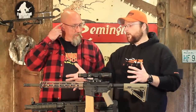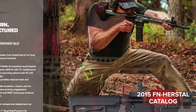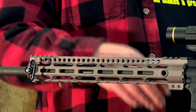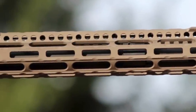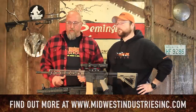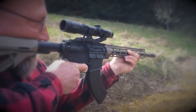At SHOT Show this year this was a very popular item, and there were even some manufacturers incorporating this handguard onto their high-end rifles. It comes complete with Loctite — you secure it to the barrel nut, put on a healthy dose of Loctite, clamp it to the prescribed torque requirements, and it sets up right on there. It comes with all the tools and everything. If you're looking to put your AR-15 on a diet, the Midwest Industries super slim lightweight M-LOK handguard system is the only way to go. Two thumbs up. As always, shoot safe, shoot straight — you can't take back a bullet, you never want to wish that you could. We'll catch you guys on the firing line. Thanks for watching.